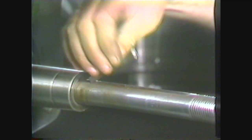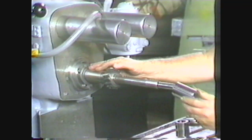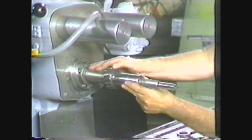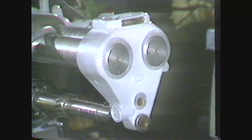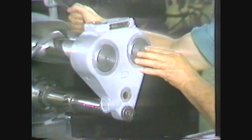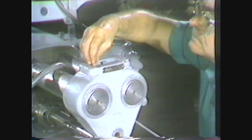A key is inserted into the arbor to drive the cutter. The cutter is positioned on the spindle using spacing collars, then the cutter is placed on the spindle, followed by more plain collars. The arbor bearing collar is then positioned on the spindle and the spindle nut is tightened against the bearing collar. The arbor support is then placed on the overarm and the bearing positioned in the arbor support. Clamp the overarm in place so it will not move during machining. When using the arbor support, always make sure the oil level is sufficient to lubricate the bearings.